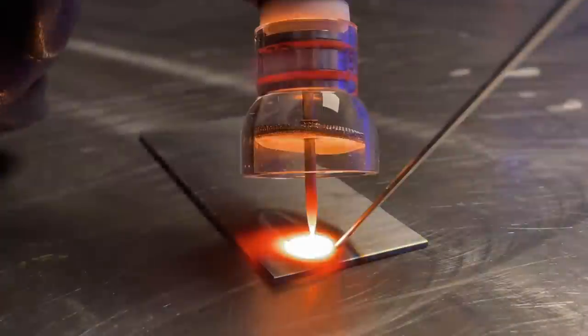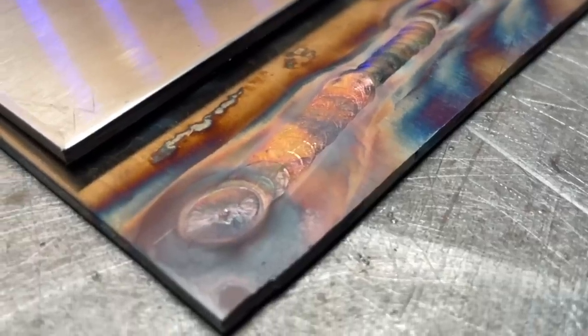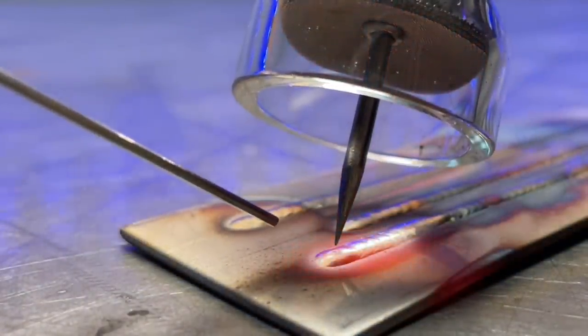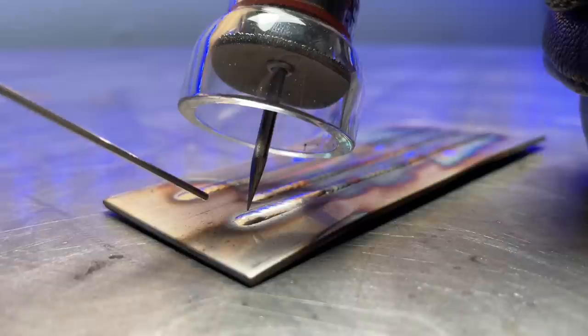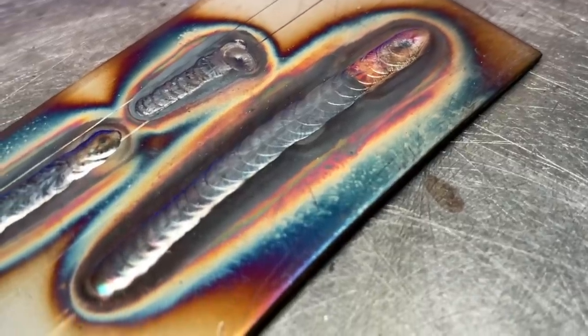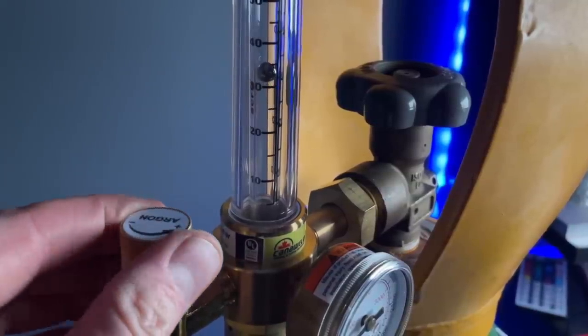When your stainless steel TIG welding passes are glowing red hot, they are susceptible to forming severe oxide immediately if exposed to our atmosphere — the air that we breathe — it gets oxidized immediately, there's no way around it. Ensure that you have the timer on your machine set for at least a couple seconds extra from what you actually need, maintain a proper standoff distance, and ensure that your torch does not move until you have finished your post flow cycle. Anytime you see excessive heat-affected zone or any oxide forming at all, you have to set this timer for a longer duration or increase your gas level through your regulator.